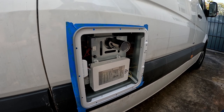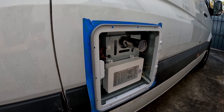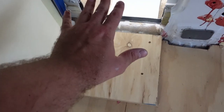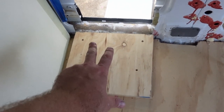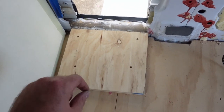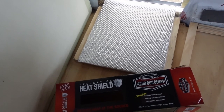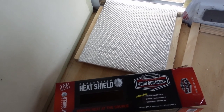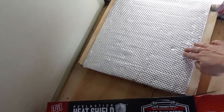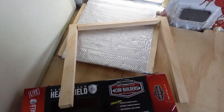The favourite thing about this is that we can actually screw it in, unlike when we did our gas box and you saw us struggling to brace that silly thing while it cured. We've counter-sunk some screws into this board, which is going to provide a proper base for the hot water system to sit on. We're also going to heat shield this — I haven't seen too many other people do that so I don't know if it's overkill, but we're doing it anyway. We were reading the instructions that came with our hot water system and they talked about having a protective heat shield, so we've laid down this heat shield from Car Builders — it's just a sticky back. We've put it along the base and we're also going to line our frame with it, which will house the box very nicely and safely.